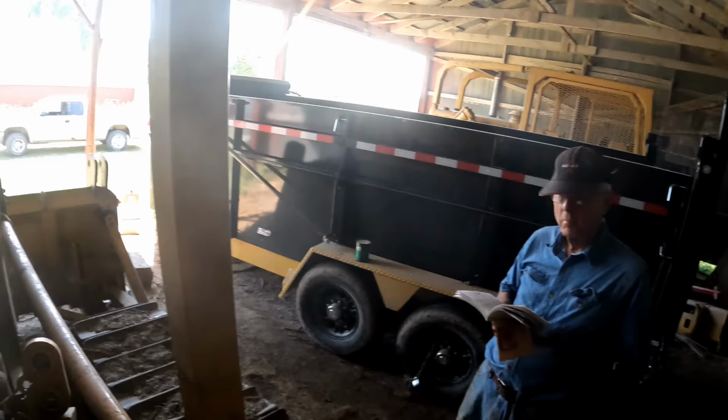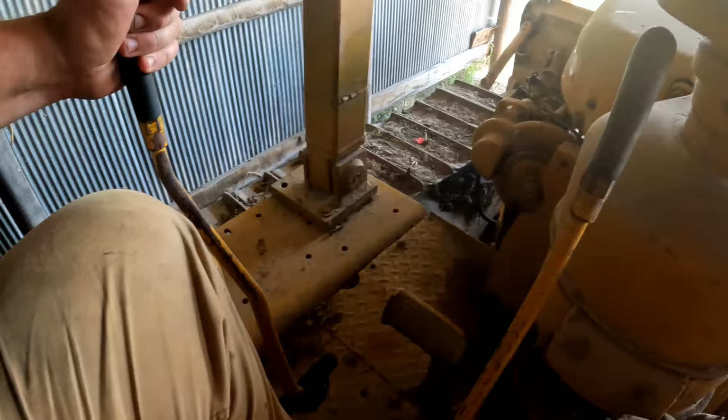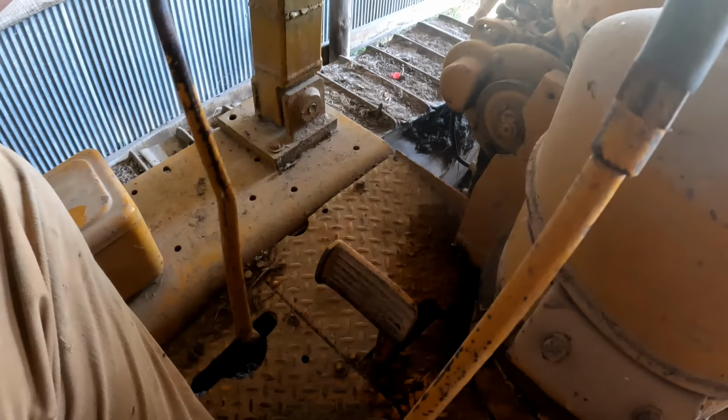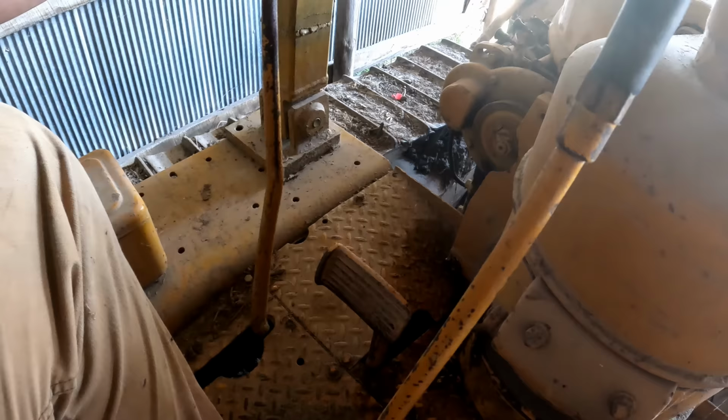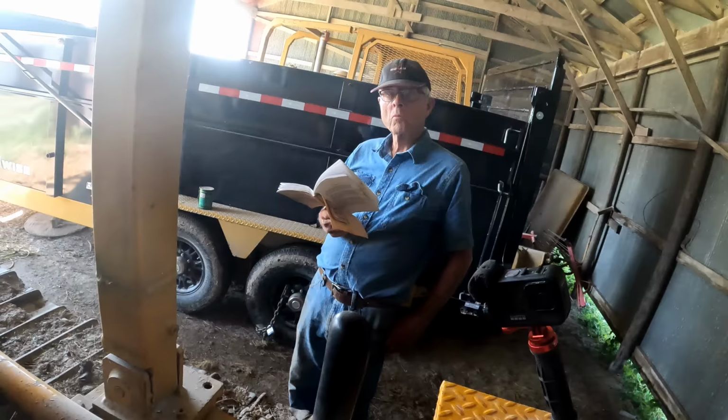So we're having issues here. So this is like the flywheel brake, and that's supposed to be engaged, right? When it's saying pull back, is it pull back's engaged? Disengage the flywheel clutch by pressing the clutch control lever forward as far as it'll go. Which is that. Which I'm thinking there should be brake on that. So I'm wondering if it's the clutch, you know, these old clutches can get frozen up. Can get rusted tight.